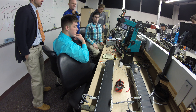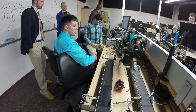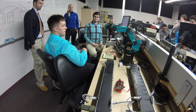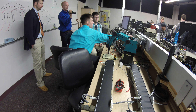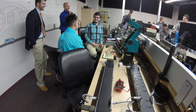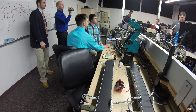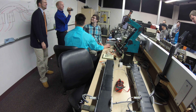This is the first project in this program. We wanted to incorporate certain components that we've worked with so far this semester, so it gave us an idea of where we stood. This pretty much simulates everything we learned throughout the semester. We have infrared sensors, analog sensors. We're using an analog module and a thermocouple that we weren't even taught yet. We have relays and a relay module — which no one really likes relays, but we don't care because we're bosses. We've got our power supplies, our PLC, and our e-stop.